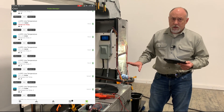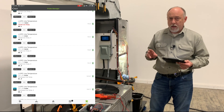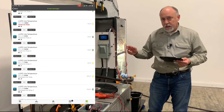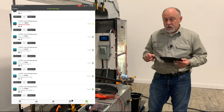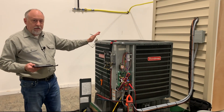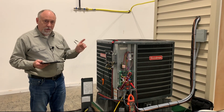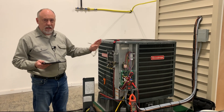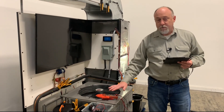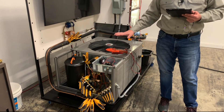This will allow you to do up to four circuits of air conditioning. We actually have two different modes: one is a multi-circuit mode, which means multiple refrigeration circuits, and the other is a multi-stage mode. So like this Goodman piece of equipment over here — this is two stage. You can have it set up to do first stage and then switch it to second stage. It's one refrigeration circuit but two stages, with a two-stage compressor. Whereas what's set up here represents four stages of cooling — four compressors, four separate circuits.